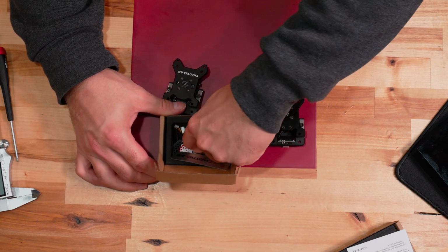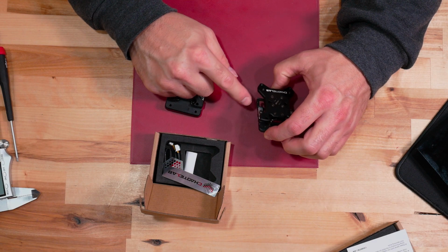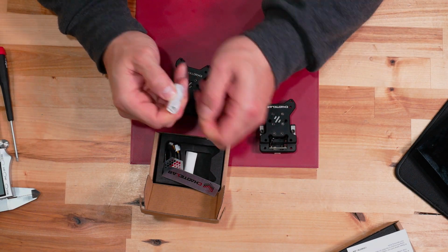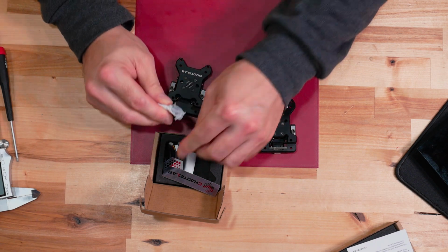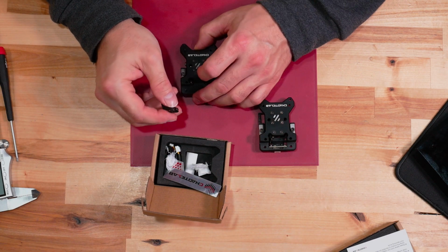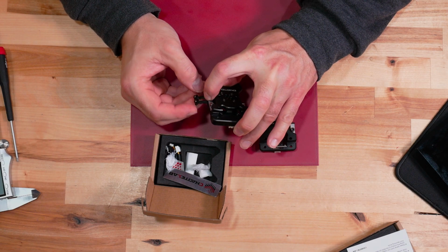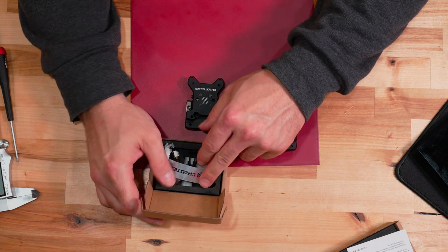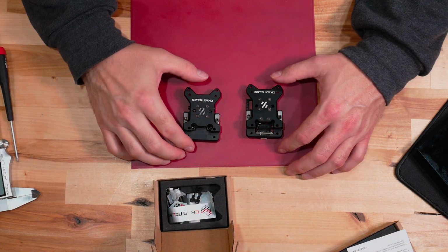One thing I will take out is this. Yes. You used to have to print, if you're using an X end stop and you needed to attach that, you had to do a printout to have something to trigger that, or else you'd wind up not having the ability to trigger your X end stop. So now, man, some good plastic. What they do is they provide you with, straight out of the package, a method for doing that. So basically you have this right here, and that will attach and allow you to have that X end stop trigger. So that's one upgrade already that we can see, and probably because people complained they had to add something to this bot, which I can understand being frustrating, especially if you're a first-time builder and you don't know what to expect.